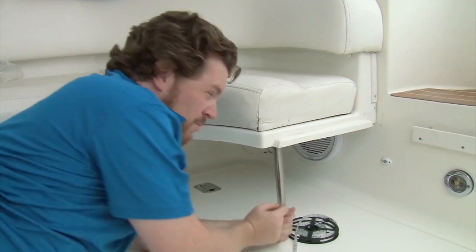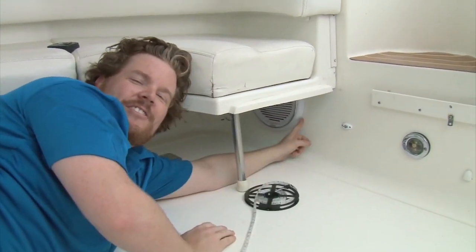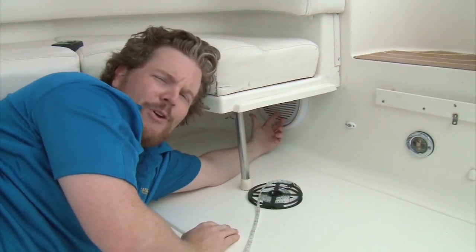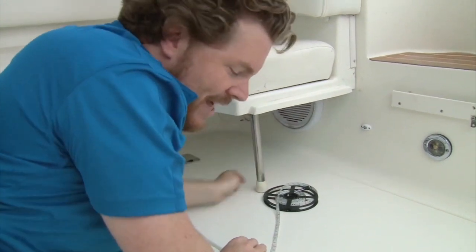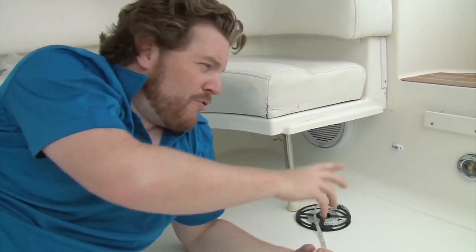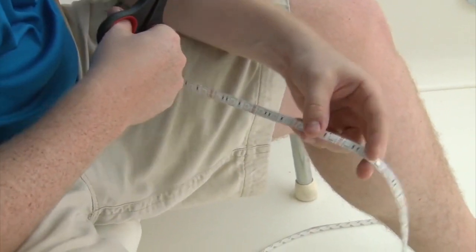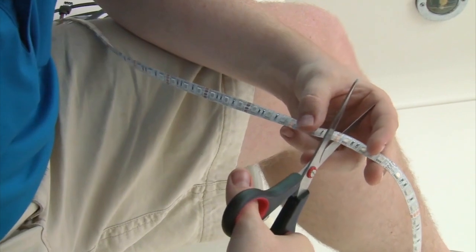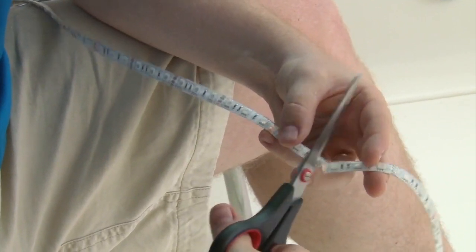Like any project, even if it's really straightforward, you might have some hiccups. What we run into here is this big speaker — it's 136 inches to here. We could just run over the top of it since it's strip lighting and easy to do, but we don't want to do that. Luckily we don't have to, because the way this new strip lighting is designed, you can easily cut it and extend it over or around any obstruction. The cutting has been made very simple — every few inches the sections have dotted lines across the connectors, and you just use everyday scissors to cut right along that line.